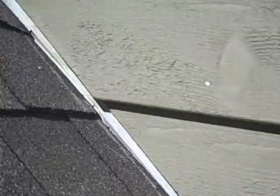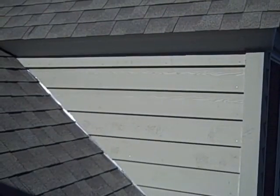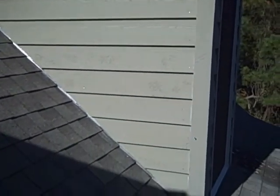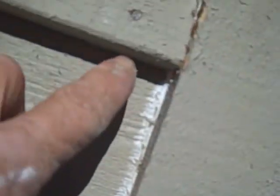The main thing is you want to make these tight. See that caulk bead right there — I put that before the siding goes in, and then I caulk it after the fact also. The next most important thing: keep your siding off the roof line, no wicking. Done deal. Notice the caulk squeezes right out from behind the siding, so it doesn't take a lot of caulking on this outside edge when you've got it squeezing out like that.